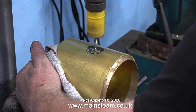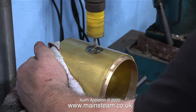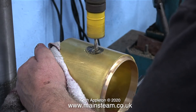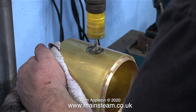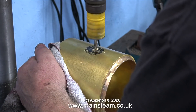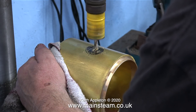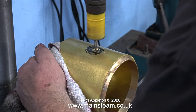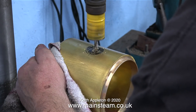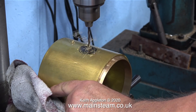Over now to the drilling machine to start the job. I made a bit of a mistake here — I doubted the mark that I made on the smoke box itself. As I held the smoke box in position on top of the machine vice, it didn't look like it was in line with the seam at the bottom. However, this is not a problem. This smoke box has been rolled from a piece of brass sheet and the ends have been silver soldered together very expertly by Philip Blackgate's engineering. The silver soldered seam underneath is very neat, but I would like it to be more or less in the centre for when I drill the larger hole underneath, which accommodates the blast pipe and the steam inlet pipe.